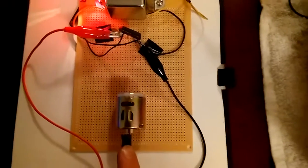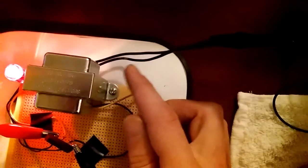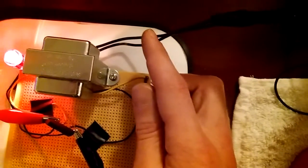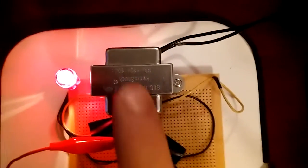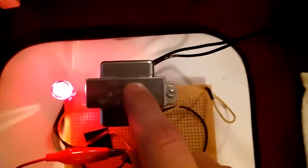I have a motor here which I'll show works — I'll put some tape here so you guys can see it spinning. So what you're looking at is it's plugged into the wall. These are our two wires — this is AC, so you don't have a positive and negative. What you do is take an old computer cord or a cord that you don't need, something that plugs into your normal wall outlet, cut it, and wire it to the back of the transformer. You can get a transformer like this anywhere for about seven to eight dollars. This one I got from Radio Shack, and you've got 120 volts AC coming in.